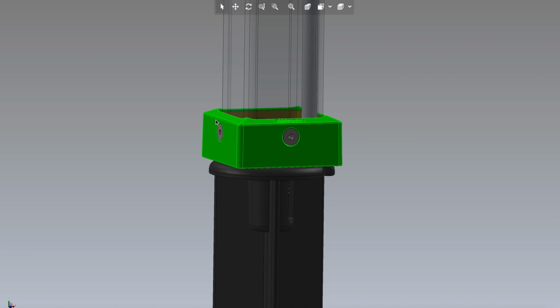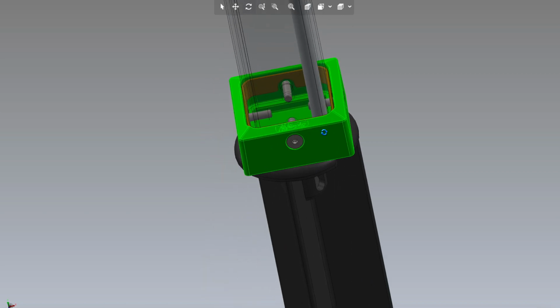So your brass base here will just sit, let me spin it around for you, will just sit nicely on the ground. Your stake threads into it, has a threaded 1/2-inch MPT thread on the bottom of the brass. It's all integrated, and the tube of the Bollard fits nicely in here. The brownish color piece is a rubber seal that just makes the tube snug up nicely to the brass piece, to your brass base. The brass base is threaded, and will allow the tube to slide in, and everything is secured nicely.